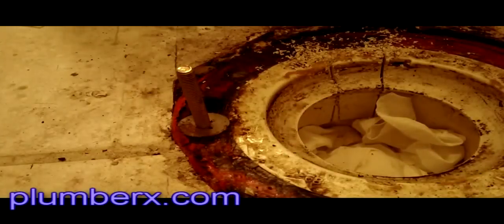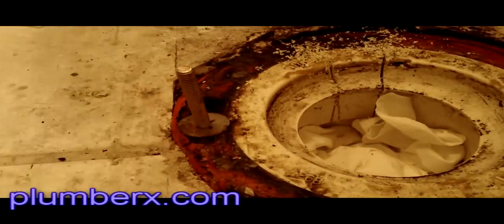And once this flange is pulled up, you'll see that this flange actually was not really down deep into the 4-inch pipe, which, I mean, it looks bad enough now, but it would have been a more serious issue later once this pipe would have just come right up out of the ground. And this is why we're going to use the extension that we're going to make.